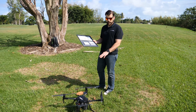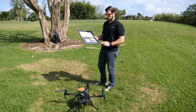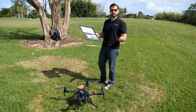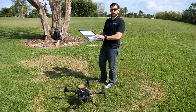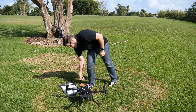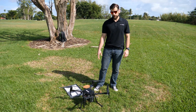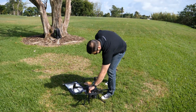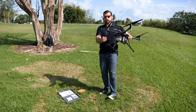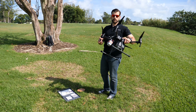What we're doing now is calibrating the camera system. The important thing is that the sensor itself has to be facing away from the sun. The calibration panel has to be on the ground and you're going to be taking a picture from one meter up. Make sure your shadow is not interfering at all. You can either take the picture from a button on the unit itself or through the application.